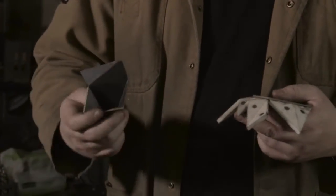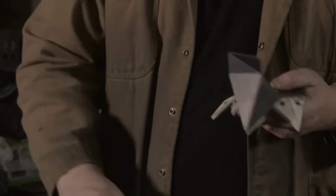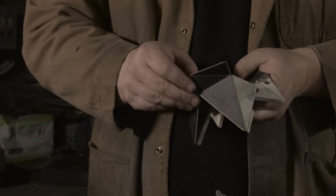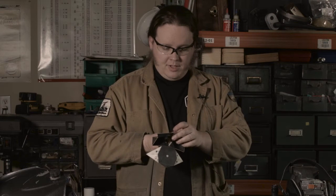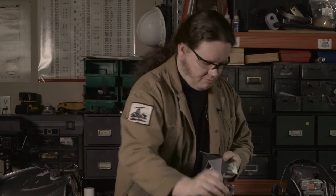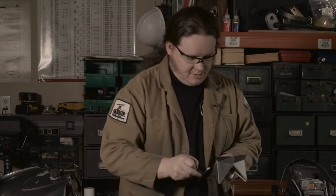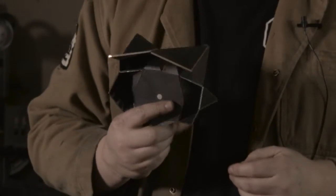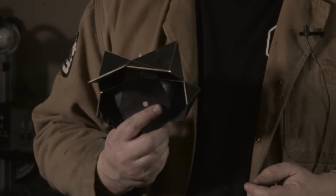The same with these rear pieces. That adds on like that and adds on like that. And they're all held together. Some takes a bit of fiddling sometimes, but for the most part, they just lock into place. And now I can weld them tack, tack, hold them together, pull off the jig, weld them the rest of the way together. Can add the side spikes. So there is, in one jig, that's about half of the base all held together, ready to go.